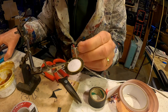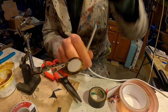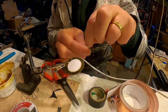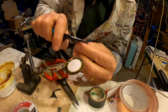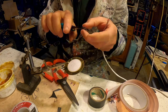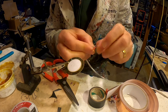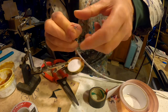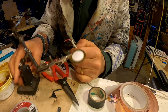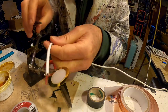All right. Next, I'm going to clip the other stuff back, just like I did with the quarter-inch jack. All right, I clipped the other two wires, and time to strip this black negative wire. 26 gauge, little dot on the stripper, and pull it out. There it is. Discard the insulation and take the recently stripped wire and that wire that never had any insulation and wind it together there. Okay. Next. Okay. I'm going to position this thing right there.